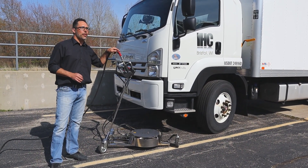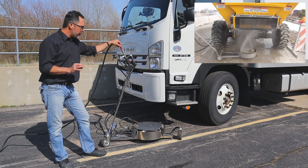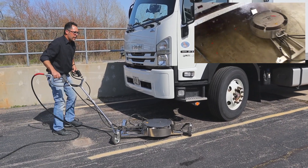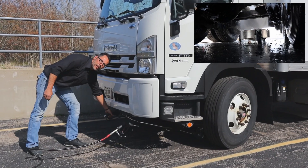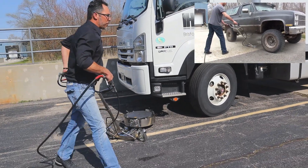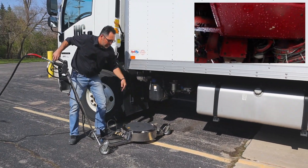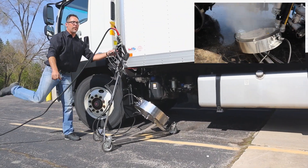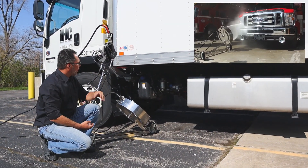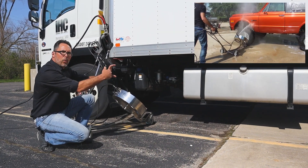What we have here is the Hurricane Pro with chemical injection — it's one of the high-lift versions and the deck height on this versus the standard high lift is the same. The advantage is it has a six-way adjustable deck. On larger fleet vehicles, the deck height gives you easy movability underneath the chassis without any real obstructions. When you come along the side of a vehicle you can get the high cleaning height, but when you work underneath the chassis — in the frame areas and C channels — you'll find fuel lines, airlines, and hydraulic componentry tucked in there. The adjustable angle lets you sweep through and clean more than just straight up, reaching that inner area.